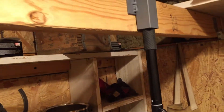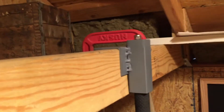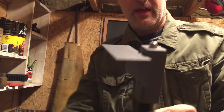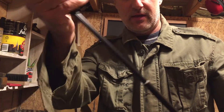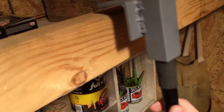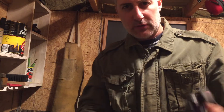When I'm banging on my pieces of work on the anvil, I get a lot of shaking and bouncing when I have the tripod on the floor. I came up with a workaround — this is nothing more than a selfie stick mounted on a bracket that I made, that goes over one of the rafters and is held in place by a C-clamp. It's just a piece of angle iron welded to a piece of square tubing with a hole drilled for the selfie stick mounting. I bought a multi-angle mount for the phone, hang it on the rafters, slide it back and forth — it stays off the floor, gives versatile angles to film from, and reduces the shaking quite a bit.